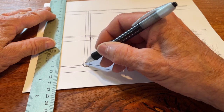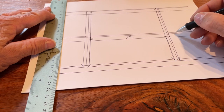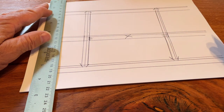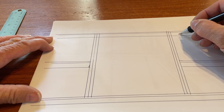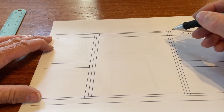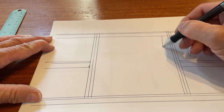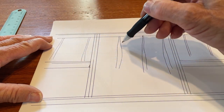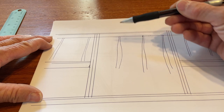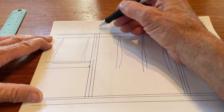Your double header should be toe-nailed into the two existing ceiling joists on either side — about three screws or nails into each one on each side. That way your cut ceiling joist won't be flopping up and down; it'll be secured by the double header and carry all the weight. Your typical ceiling joist in a garage is a 2x6 or 2x8, really just for holding up drywall. I like to pick a ceiling joist closest to a wall so the hoist's weight is supported by the wall, not the ceiling joist itself.